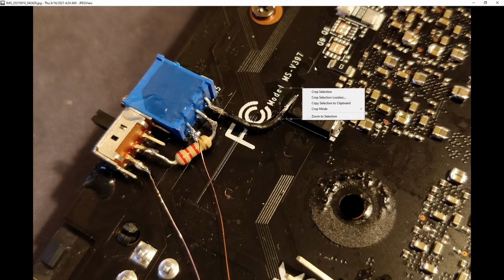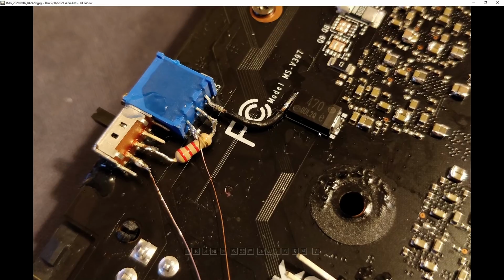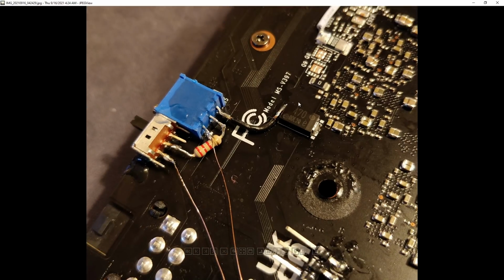This is the ground side of a molded SMD capacitor. Fun fact, you might be used to the marking on through-hole capacitors indicating the ground side. No, on these that's the positive end. Anyway, that 10K ohm potentiometer is also connected to ground, and then that 2.2K ohm resistor goes to this switch over here.